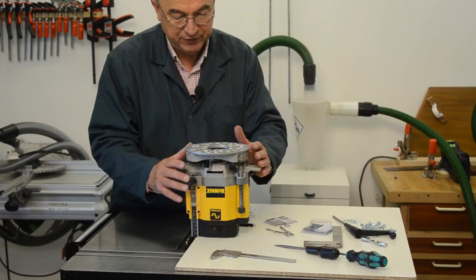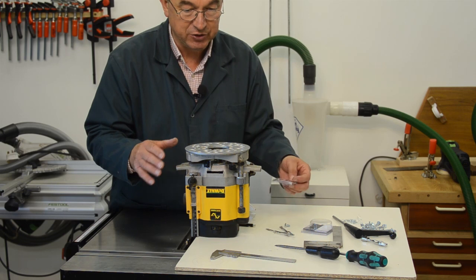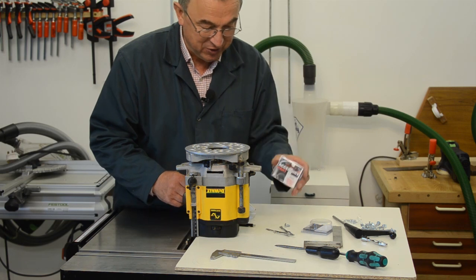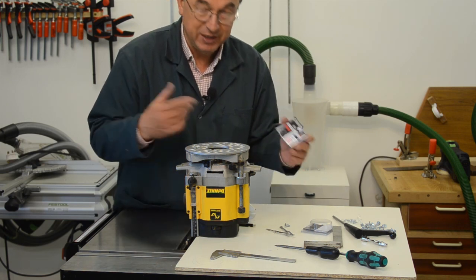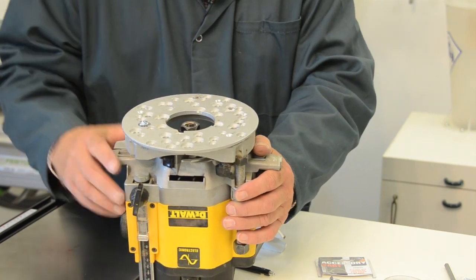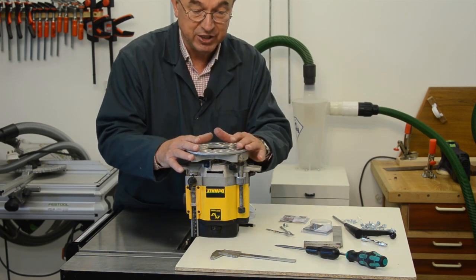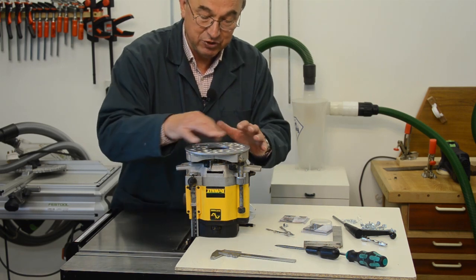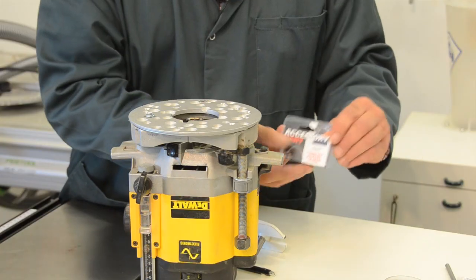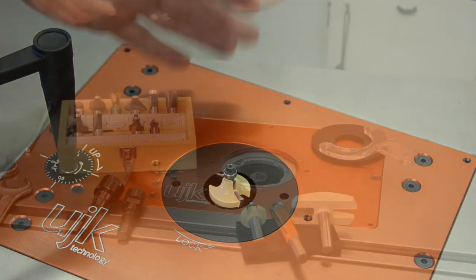In the instructions for the router elevator, it suggests you put the universal plate on with screws and tells you the right size screws to get from the Trend Accessory Pack, which Axminster sell — it's only a couple of pounds. I didn't bother and used some of my own M6 screws, but the heads were not very clever. As a result, when I put the router into the setup it was not quite central, and I didn't like that. So I went and got the Trend screws, and now it is nicely centred, just as it should be.